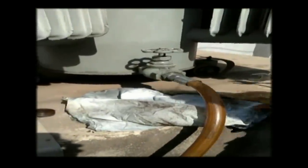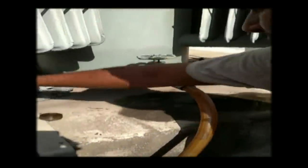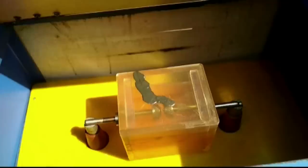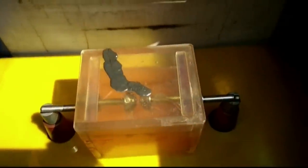The incoming oil is taken from here, connected at the sampling cock, and then this line connects to the transformer oil filtration machine input side. The incoming oil goes into the transformer oil heating chamber, and from that heating chamber the output line feeds into the conservator tank as shown in this video. This process is carried out for up to two hours.